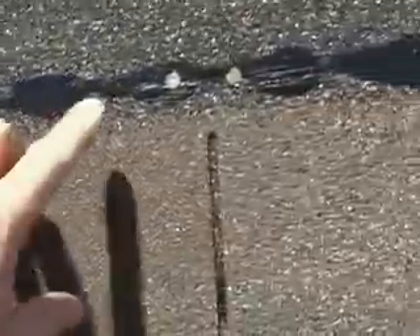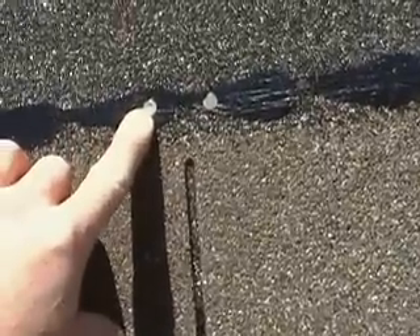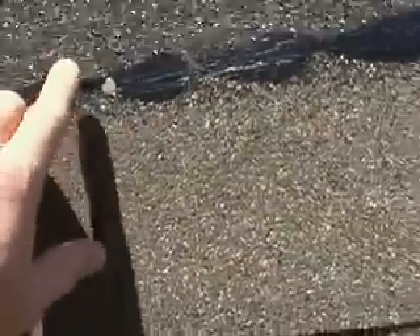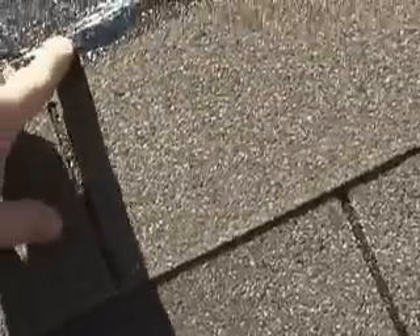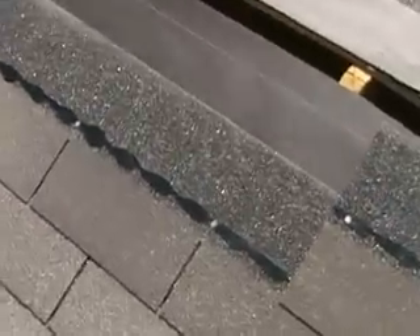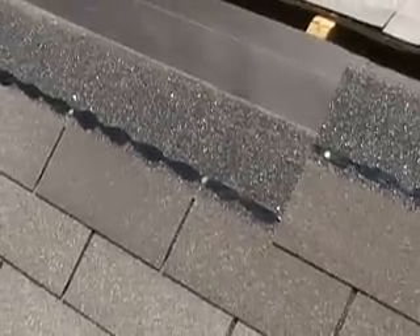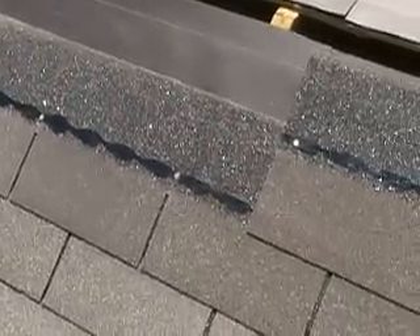Also, if you're using a pneumatic nail gun like I am, make sure your pressure is set correctly so the nails aren't tearing right through the shingles. Make sure the heads are nice and flush, and keep an eye on that — because if you shoot the nail all the way through the shingle, those shingles aren't going to stay on the roof very well. Thanks for watching the video today. I hope everybody has a great day and we'll see you next time. Take care.